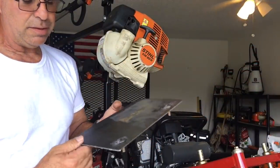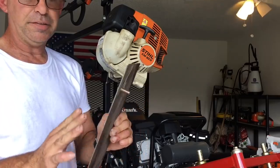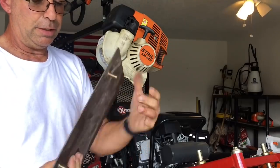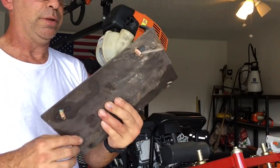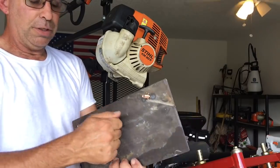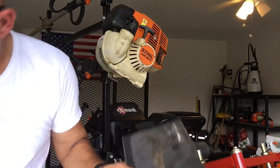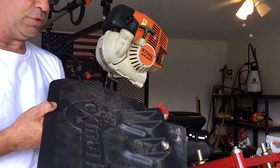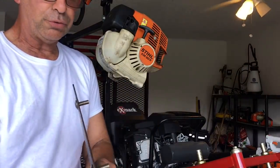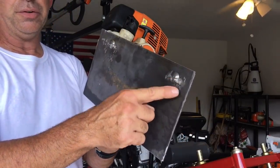What we have here is a 1/16th of an inch steel plate — it's thin but it's thick enough that it won't bow. It'll take a shot, it'll take a rock, it'll take anything. If it would go through this, then it would have gone through the plastic chute anyway. This is solid bare metal steel, and what I did is I got a couple of carriage bolts off of the mount here. I drilled the holes through the metal and I tack welded the head of the bolts to the steel, so I don't need a wrench on this side.